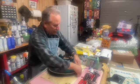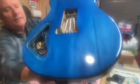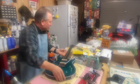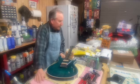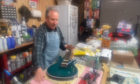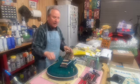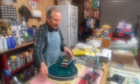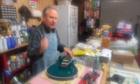Let me unplug this and hold it up so you can see the wiring. You can see that orange drop in there. A long time ago, the great Steve Spalding told me never to cut your pickup leads short. So I just left them at the length they came with and wire-tied them. The point is, if you cut your wires real close to the pickup, the next person is going to have to do a bunch of soldering and patching — always leave your wires as long as you can while still looking good.